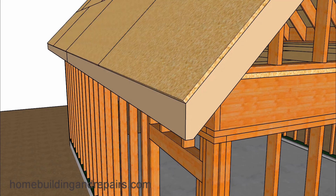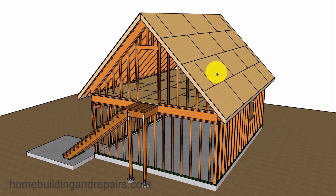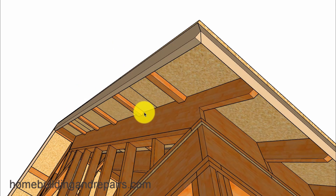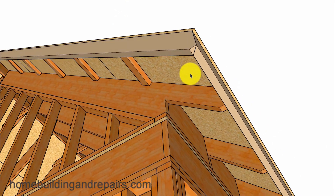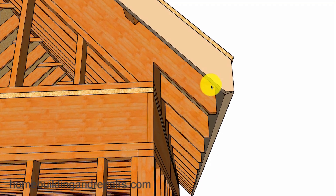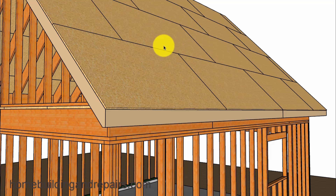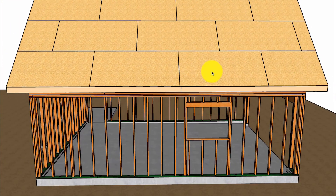For the last part of the video, let's install our roof sheathing. I wanted to show what a smaller piece of roof sheathing would look like and how some of us might be tempted to use them because of sheathing prices — spending an extra $100 or $200 to properly sheet a floor or roof is worth considering. Let's also look at the underside of the building: the roof eaves, rafter tails, and how they've been notched so you don't need larger fascia board. Hopefully if you live in an area where it snows, the snow won't be sticking to this steep roof.